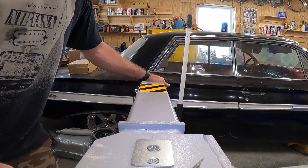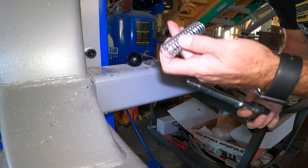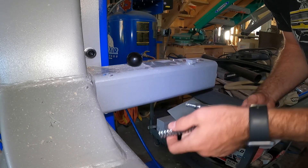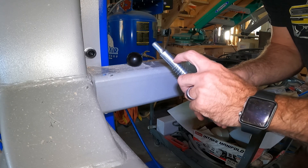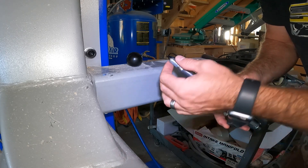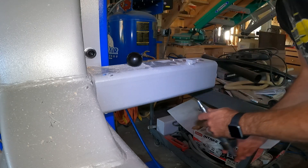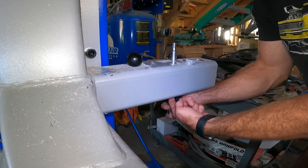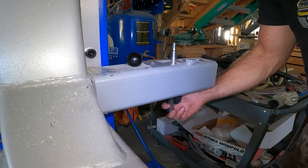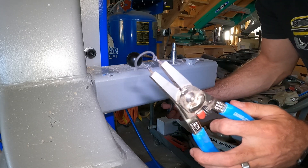You've got about 30 degrees. I can't find any pictures where the spring is visible, so apparently the spring is in there. It's got a snap ring groove and it came with a snap ring kind of loosely placed on it. I think what happens is you come in from the bottom — you can actually fit the spring through the bottom hole here — and then I've got to put the snap ring on it. So if you don't have snap ring pliers...